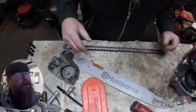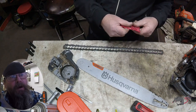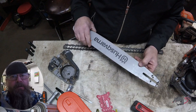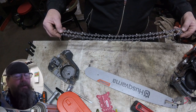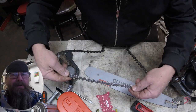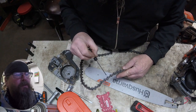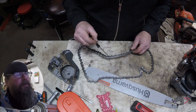It binds up. Obviously because it was in a homeowner's hands, the first thing I did was take a look at how the chain rolled over the rim drive and over the sprocket. Now I'm just verifying that they have a 325 pitch chain on a 325 pitch bar — pretty much can be done by eyeball, but for visual effects on the video we use a little gauge. If you look real close you can see the highlighted shiny spots where the light's reflecting off the tips of those drivers — that's where they're smashed.